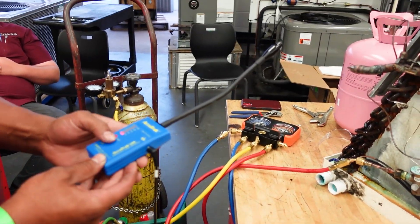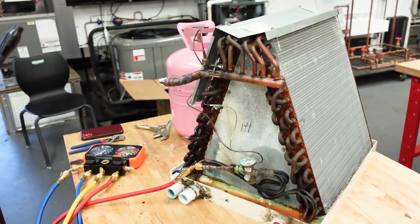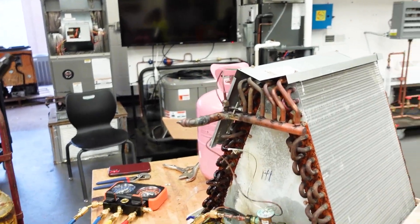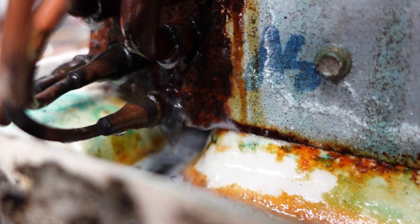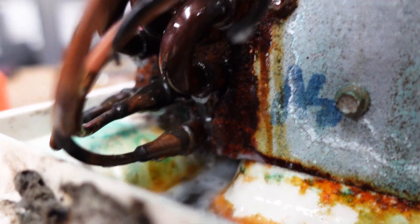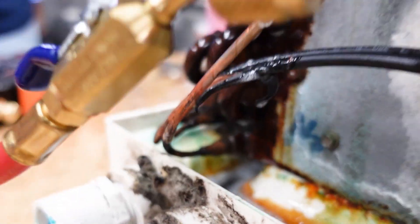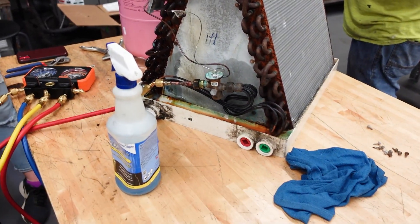I was really impressed by how easy it was to find the leak with that. It really helped us pinpoint it pretty quickly. So now we're going to go ahead and just spray some bubbles on it and show what that looks like. If you watch right in that area, you're going to get some very, very fine kind of cocooning — some foaming there. You have to watch it for a while to really see it. It's a very small leak, right here where it meets the plate. You'll see that foam just sort of builds right there. We've confirmed that that is where the leak is with multiple leak detectors. The ultrasonic is really the winner as far as proving it — it's a very, very small leak. I'm convinced, honestly.